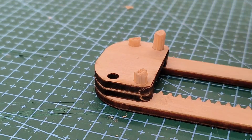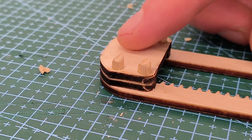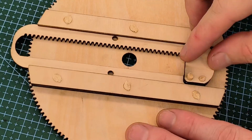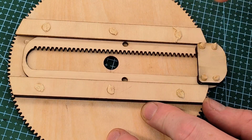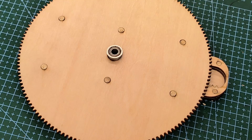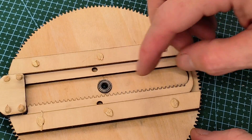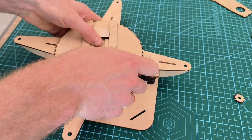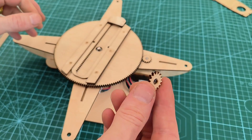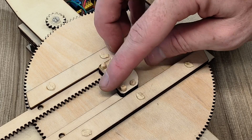This platform will be used to place our magnet on. I got some N52 magnets and it will go right on the top here. Just make sure that it slides freely and doesn't catch on the sides. Then we can put our bearing — it has a five millimeter hole in the center and will be able to go over the shaft of the stepper motor. Put it on to the middle motor and make sure it moves the other gear smoothly, then put the last smaller gear on the middle. When you slide it, make sure it can go underneath the little platform where we put our magnet.